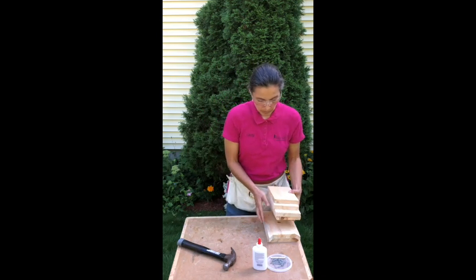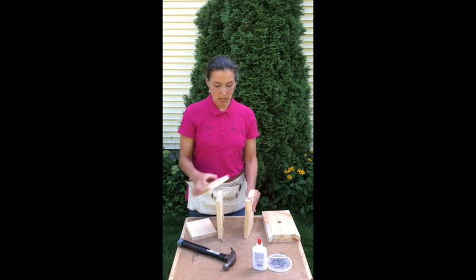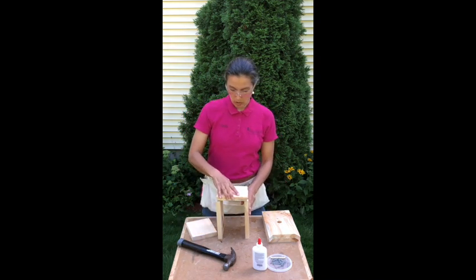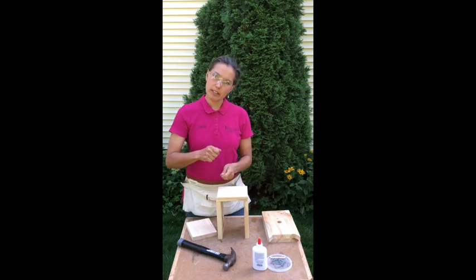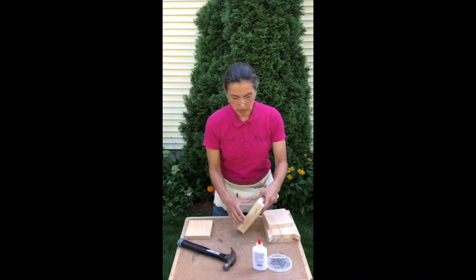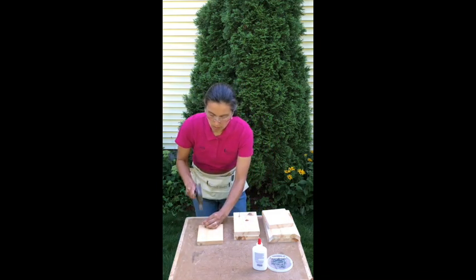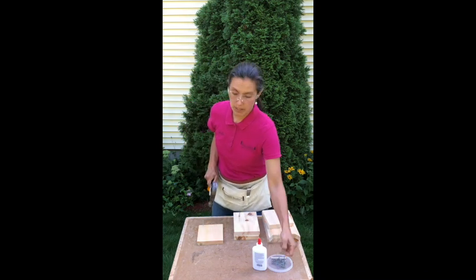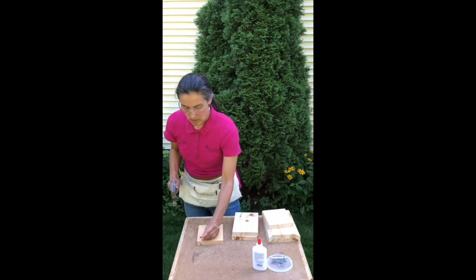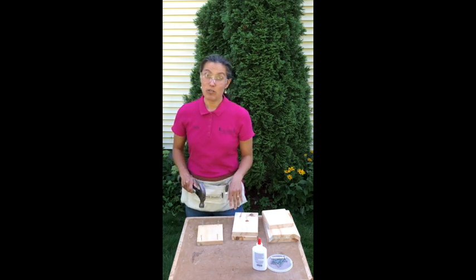So, let's get started. We're going to put the two sides and the top and bottom together first. There are a lot of knots in my pieces of wood here, so we're going to avoid those as much as possible because they're just going to bend the nails and make us frustrated. I like to start my nails right on the bench. You want your nails to not be too close to the edges because that will split the wood, but you also don't want them too far in. When you're starting your nails, you want to get them in just a little bit, but you don't want to nail into your bench or your floor because then it's really hard to get the piece of wood out.